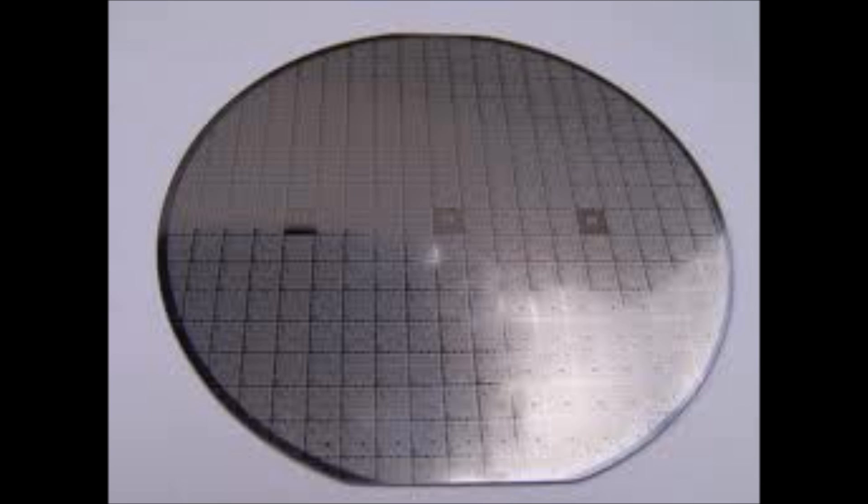Are you close? Yes, we are very close. The readout circuit is not the key thing — the key thing is the performance of the device. There's nothing else required in that chip other than the readout circuit to function. We also do not have the diffraction grating on top yet. That's a critical step — the design of the diffraction grating — because the infrared signal is weak, so we need to increase absorption to amplify it and make it stronger so the device can detect it.